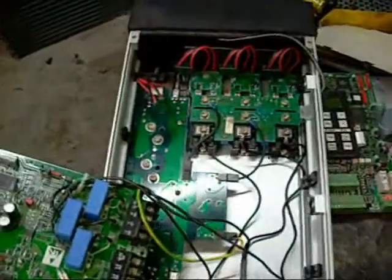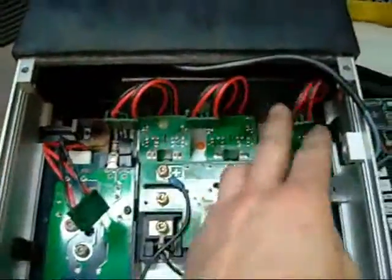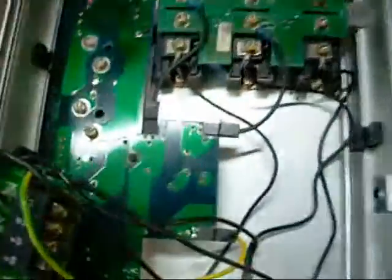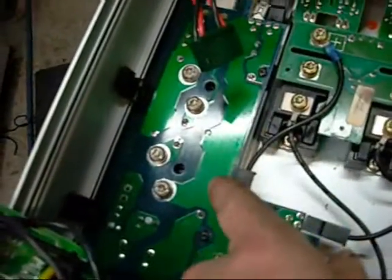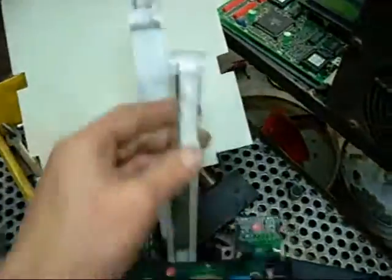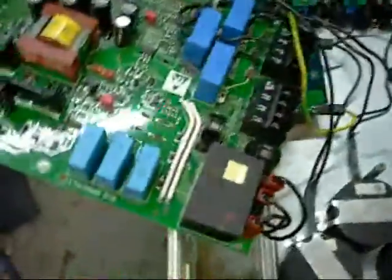Basically what's happening inside a VFD is your three phases - one, two and three - are being taken from AC form and converted into DC form with a capacitor bus. Two big electrolytic capacitors up here. These are your solid state rectifier packs - much bigger ones here from a significantly larger VFD that I scrapped some time ago. These connections hooked up to four very big capacitors, heat-sunk onto the back heat sink panel in the machine. And again there's your coils.